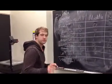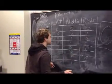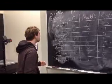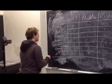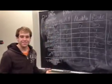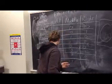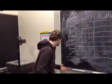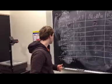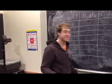In the case where we're trying to follow the line, if you sense tape on the right, you'll try to follow that tape. If you sense tape on the left, you'd also try to follow that tape by turning left. Next, if we are trying to follow the line and we're successfully on the line, our left, middle, and right sensors would all sense a 1. We would simply keep right on going because we're doing great. But what if we did keep going when we sense it on all 3 sensors?